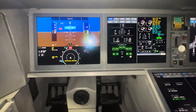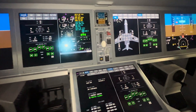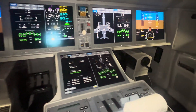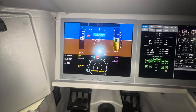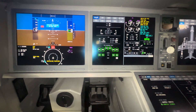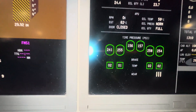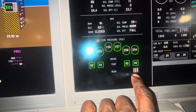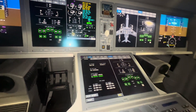Welcome back to another video. Today I'm going to be showing you guys a day in my life as an aircraft maintenance engineer. This aircraft is here for a quick service check, and during my service check I noticed one of the brakes is out of limits. For the Airbus 220s, whenever the brakes are out of limits you can actually see the three stripes on the display units. So I'm going to be changing the brakes.